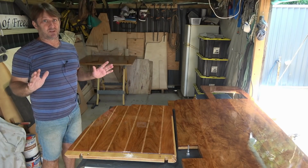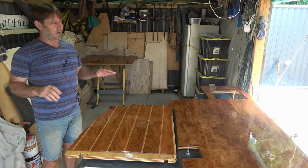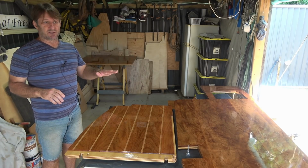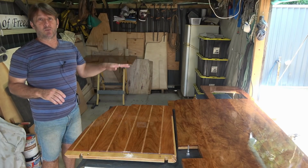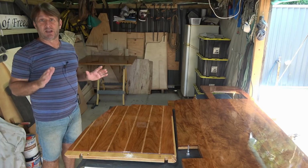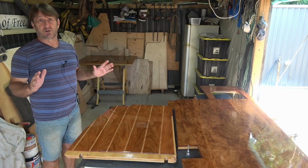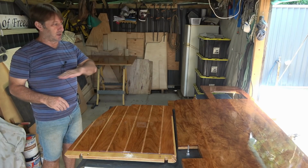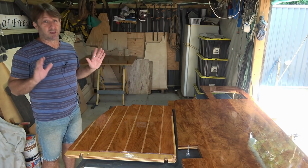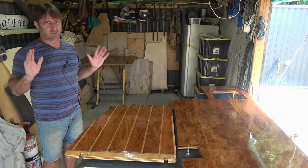So it's the morning after getting that fantastic all grip gloss coat on, and so now the plan is to get them lightly sanded with some 240 grit and then go through the cleaning process of vacuuming, wiping, wax and grease remover, and then I can get that final coat of the satin matte on, which I'm really looking forward to, seeing the final product.